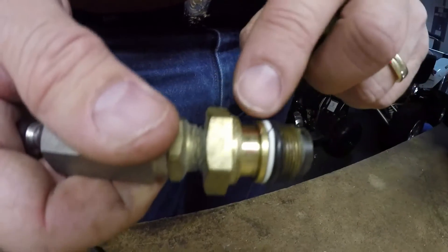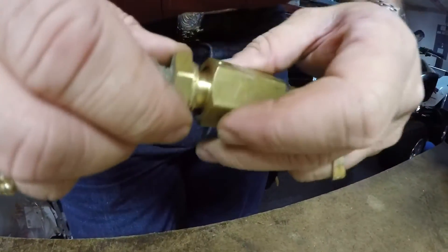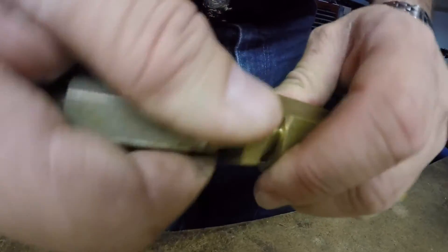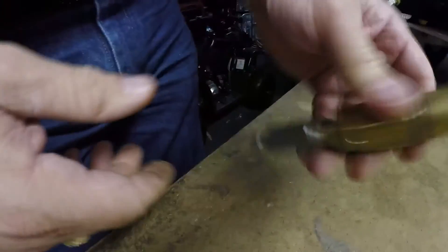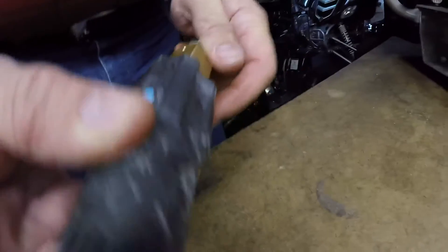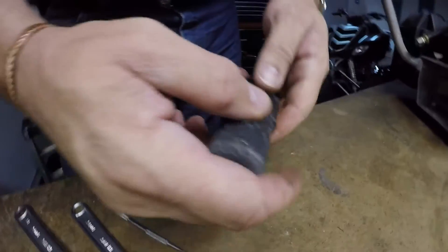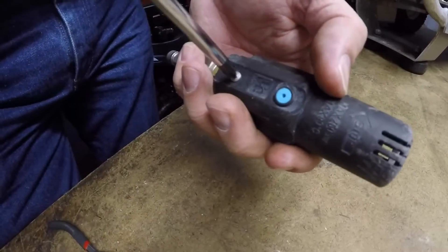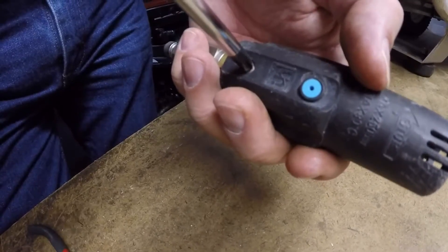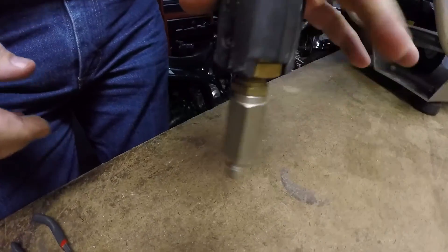Be careful not to smash the o-ring and backup ring when putting this back together — just make sure it gets in there all the way. We don't want it too tight because we want it to rattle when it's working. Put the nozzle housing back on — because we have the o-ring on there it's a little more difficult, push down, there we go. Make sure you have the little hole lined up with the screw hole so you can put the Phillips retaining screw in. It retains both the cover and the bottom piece. Tighten it up, make sure it rattles — there you go, rebuild complete.